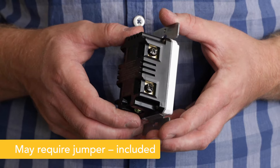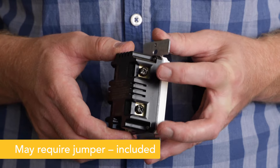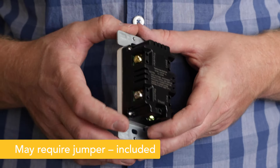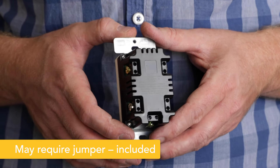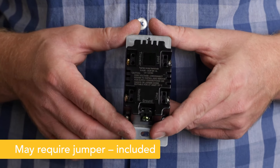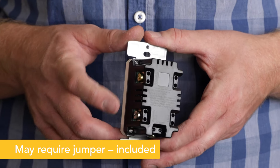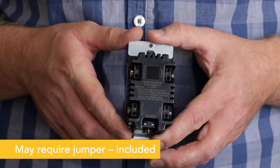The two black terminals are your load and line. Your line, or hot, connects your timer to power. The load wire connects your timer to the lighting. This silver screw is where your neutral connects — usually a white wire or bundle of wires in the back of the switch box. The green terminal is for your ground line, which is either green or bare copper wire. In three-way installations, this terminal is used for the traveler wire, which is often red or black, but can be other colors.